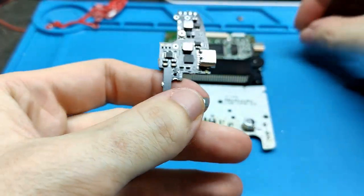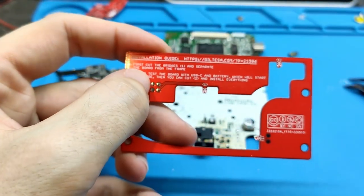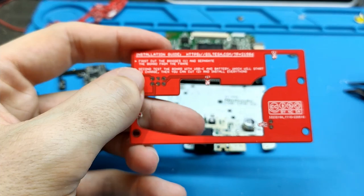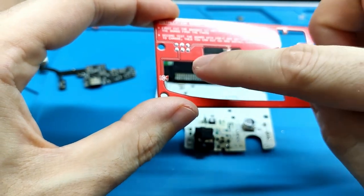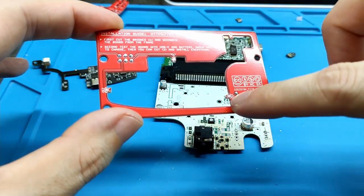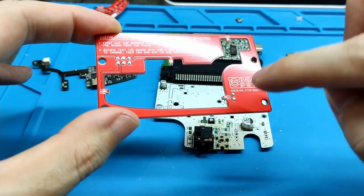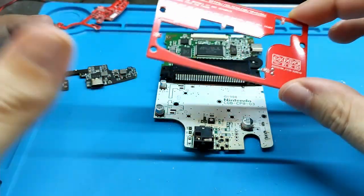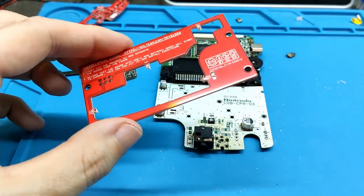The old version, in this bridge that includes the frame to the main board, included small holes that made this easier to cut. The problem here now, I haven't said, is that the frame includes some wires. Okay, here two, another two here, another two here. In total eight wires, because this frame includes some pads that allow me to test the board one by one and check the zone, check the charging, check everything.